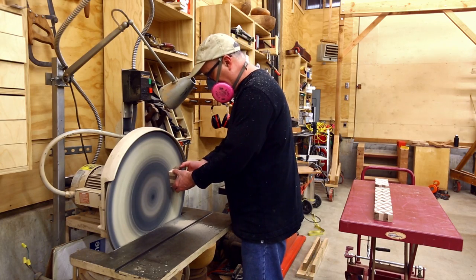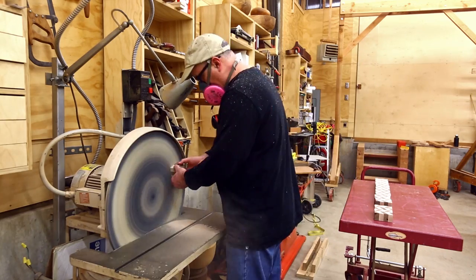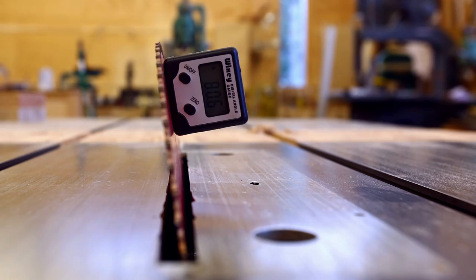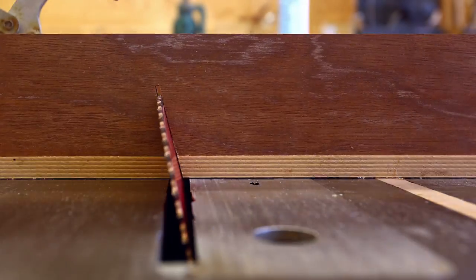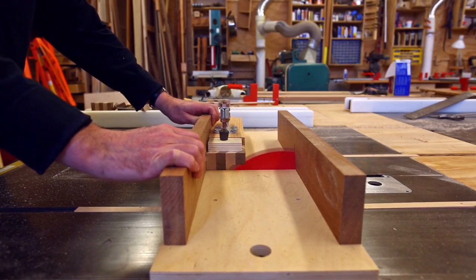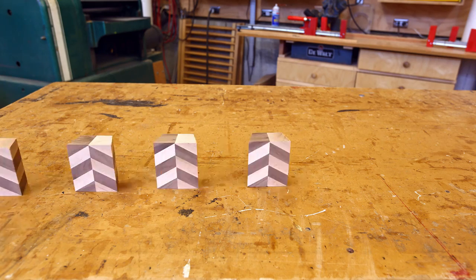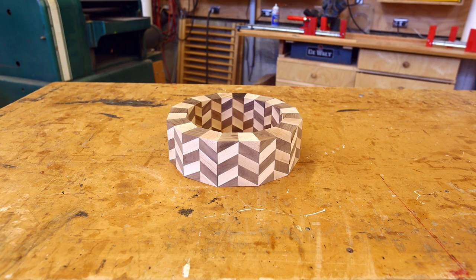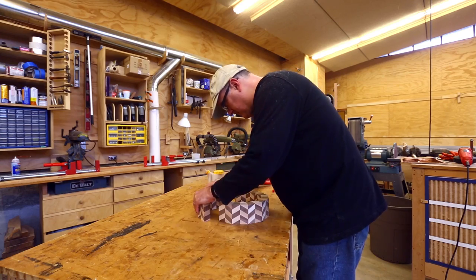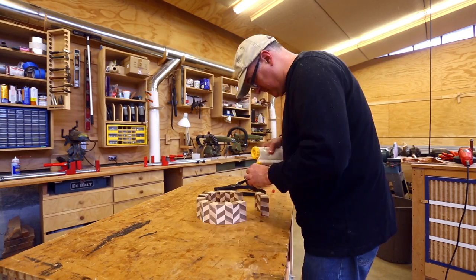To cut the angle so this will make a ring, I needed one side to be flat so it would sit flat against the sled on the table saw. I sanded one side on each piece. Then I angled the blade and used a different sled that I can clamp the piece in and cut that angle. I'm doing 12 segments, so that's 15 degrees on each side of each segment. Making the segments this way means the grain is side grain on the side of the bowl, which makes it easier to turn. In past patterned bowls I've done it by making a sausage with the pieces and slicing off the ends — that's easier to make the segments but then harder to turn because you're turning end grain on the final bowl.